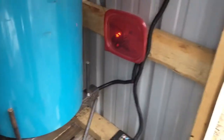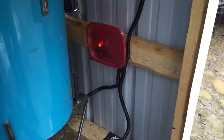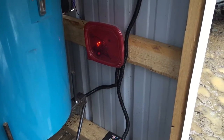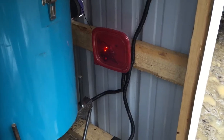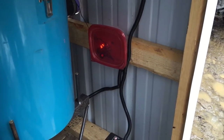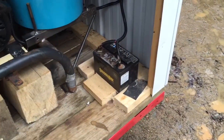On the ignition switch, the shutoff switch, I have wired on a temperature sensor that I got from Amazon for like 12 bucks. It's reading 3.7, which is in Celsius. I set the shutoff at negative 0.7, which is around 30 degrees Fahrenheit. I know the sap will flow when it's colder, but our releaser freezes up.